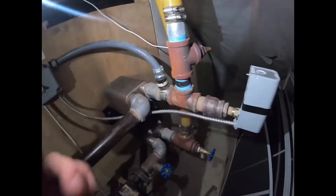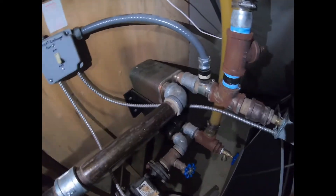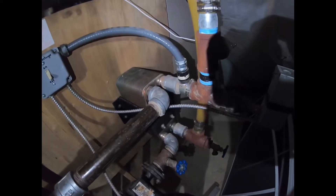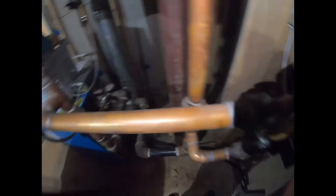Right now our heat exchanger pump is off and these valves are off as well, so any hot water need is running off our oil. This is all isolated and we want to make sure it stays isolated — we don't want the system to think we're trying to heat with wood. The water is going to come in through the supply, run through the heat exchanger, and back out to the unit, but we're not pulling any of that heat since we're not actively heating. Just make sure you're literally just moving water — no blowers on, no dampers, not trying to run the unit as if actively heating with wood.